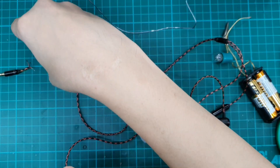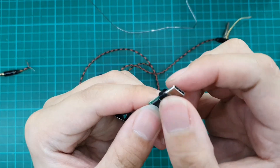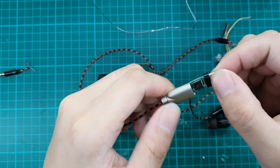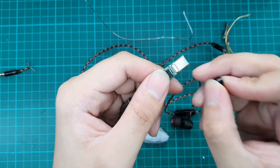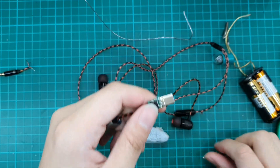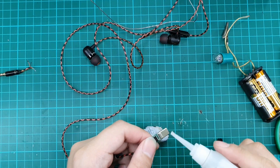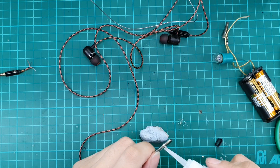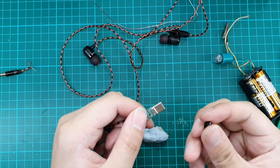As you can see, the connector comes in a few parts — there's a front capping and a back capping that slots in perfectly. We need to glue down the front capping onto the USB-C connector itself. What glue should we use? As always, super glue. Be careful not to pour too much — super glue is very permanent for this sort of job.